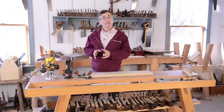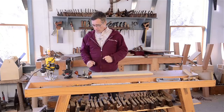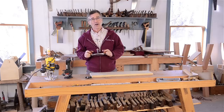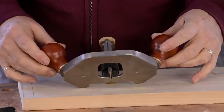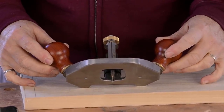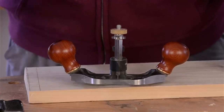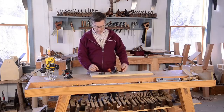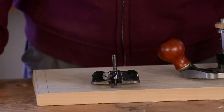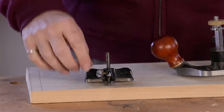Let's talk about tools, because there are ways of making our lives a little easier or harder if you prefer. For those who like to make it a little harder, we have hand tools. This is my favorite hand router with its one-sixteenth of an inch tooth on it, and I use this for leveling the bottoms of grooves. This smaller router has a much bigger tooth, but it's really handy for something I will show you later.